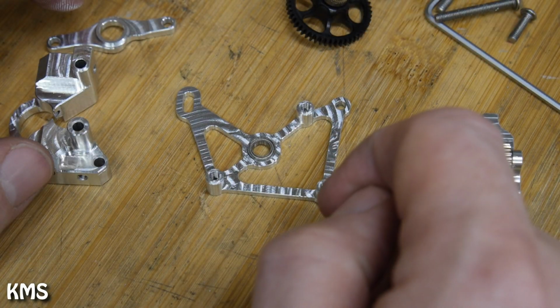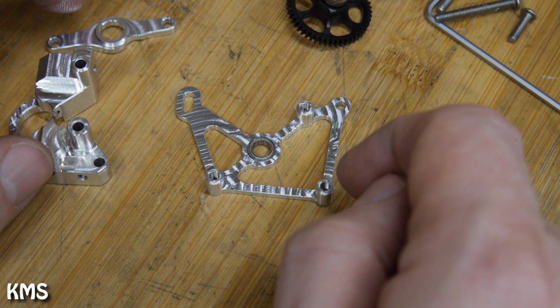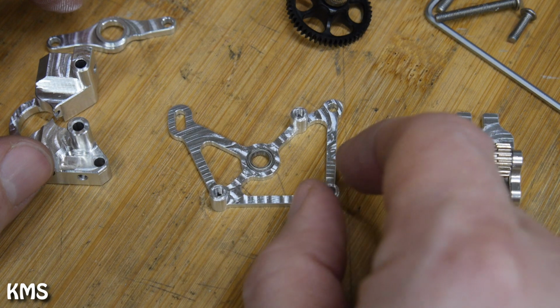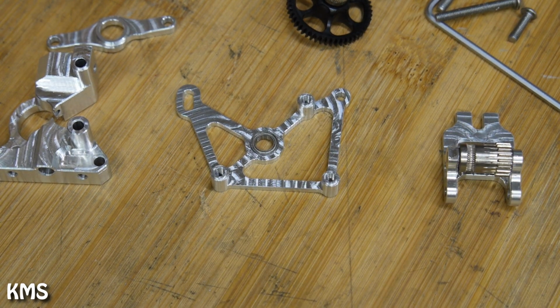In terms of CNC machining, this part is rather straightforward. It can be done from one side, so no fancy stuff here. I'm using a blue tape method to hold the raw material. It's nothing more than taking some blue painter's tape, putting it down on your machine bed and on the underside of your raw material, and then taking some super glue to stick it together. This gives you enough holding force for rather light machining.